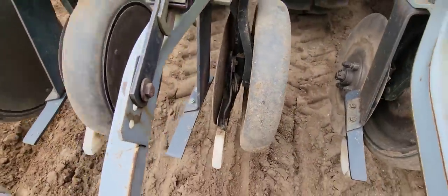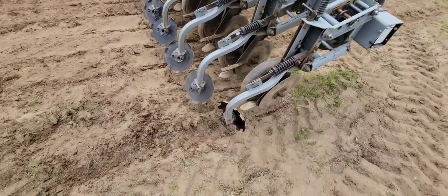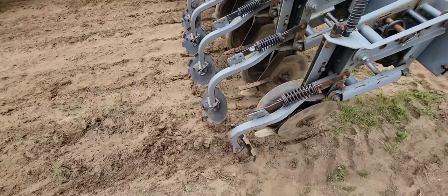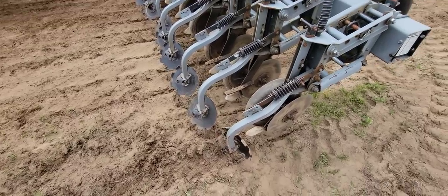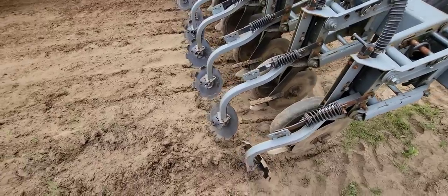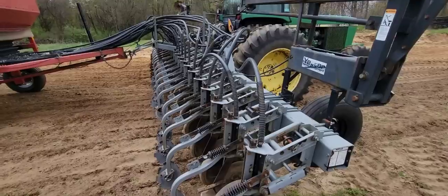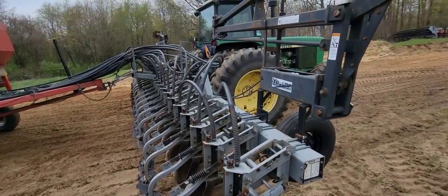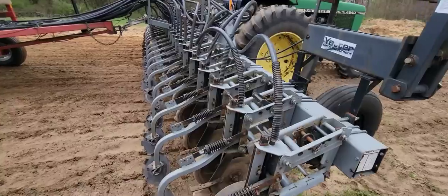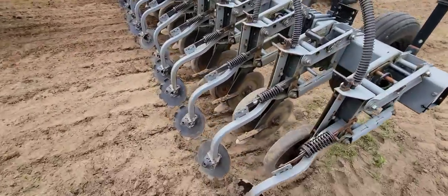So you kind of get the idea — I'll go through the rest and check them. That one's bent, I need to fix it, but it's fine. This happens when you back up along a road ditch — it'll bury you in the ground and bend them. Happens quite often, especially if you can't raise the three-point hitch very high. This tractor has shorter rear tires so the three-point doesn't raise that high. On the 49-55 I can raise it pretty high because it's got taller tires. I can fix that rather quickly.